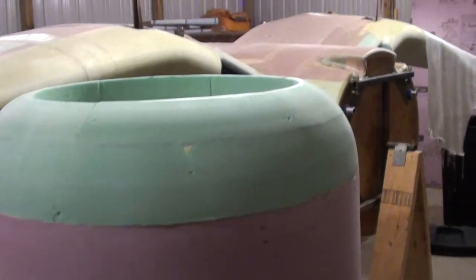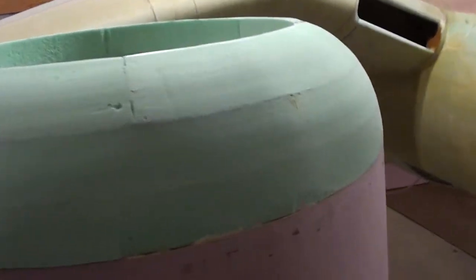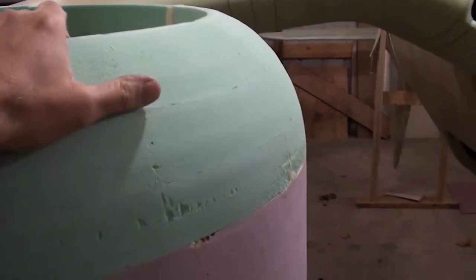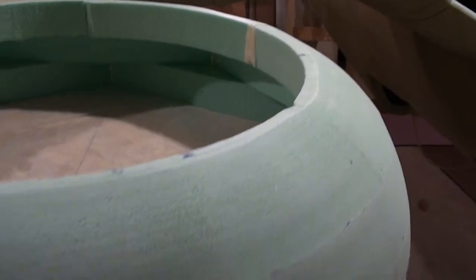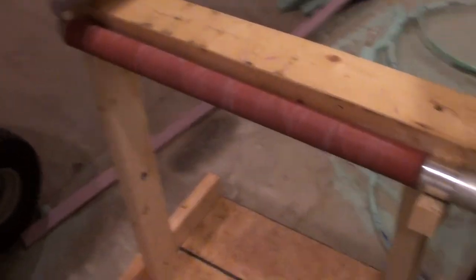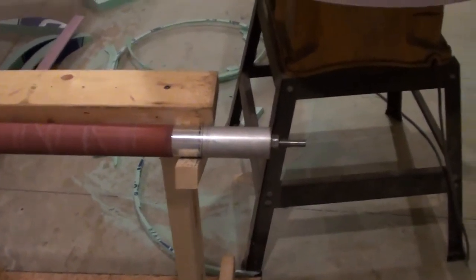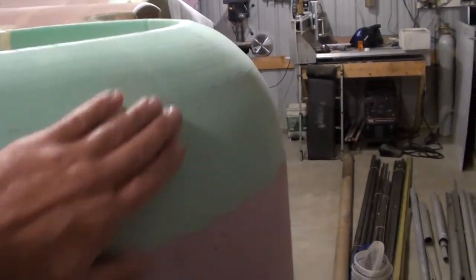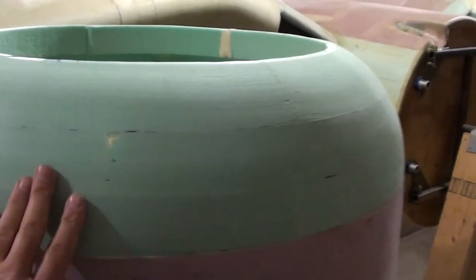It's been about another half hour of sanding and I now have it to its basic shape. Probably a few little low spots here and there, but what I'm going to end up doing is putting it back in my jig. I'll have to expand it — this will have to be moved out about five more inches to get that in. But I'll put it in the jig and spin it and probably finish hand sanding this to shape. May have to use the roll sander on it a little bit just to clean up this edge. But that's where I'm at. It looks pretty good — almost two hours worth of sanding.